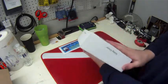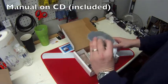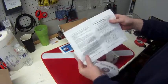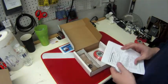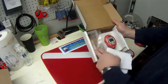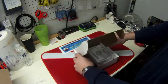So this is what you get — the package comes like this. When you open it up, you have a manual on CD. I like it; they're going green, not printing out a whole lot of stuff and wasting paper. You have all your checks, the serial numbers to the individual sensor as well as when it was installed, since sensors have a lifespan on them. You have the unit itself and then the adapter for using on a DIN or yoke tank that goes onto the bottom of the unit. Since I don't want to break this open — because when the sensors are exposed to regular air it starts wearing out on the life — we're going to leave those sealed.